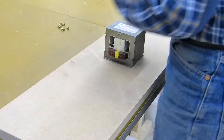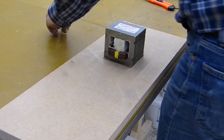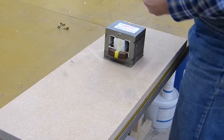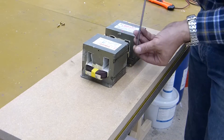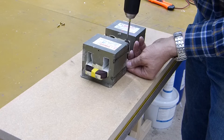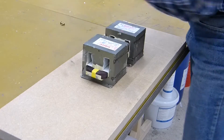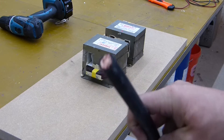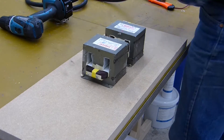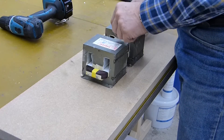As this has only been a test, I mounted all the components on a wooden board. For the final version it will be housed in a metal frame, but this is just the first test to prove if it works or not. As you can see, I mounted the two transformers in a row and I'm not using two independent coils for each transformer — I'm threading the 70 square millimeter welding wire through both transformers at the same time. It saves space and makes the external wiring a little bit easier.